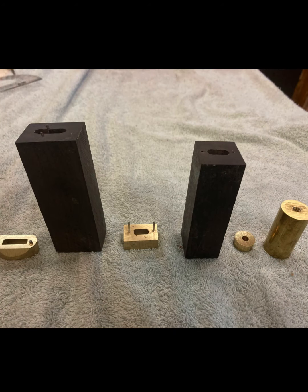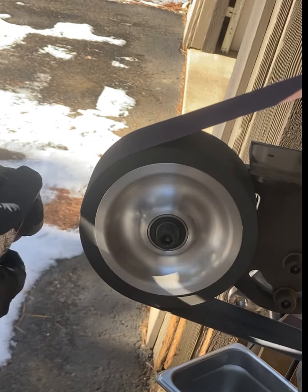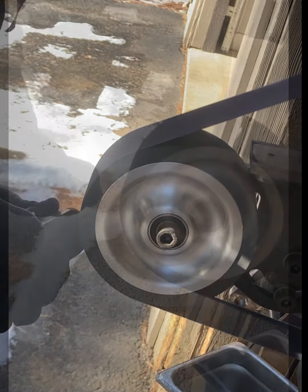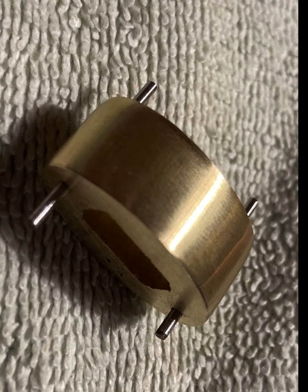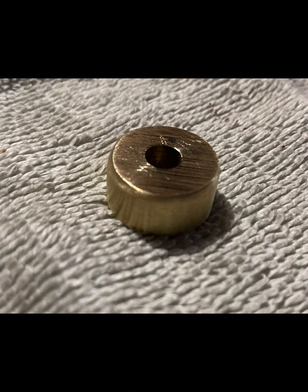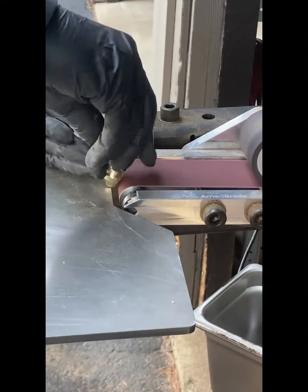All of the pieces of the handle assembly now have steel lineup pins in place. Next I will begin to carve the individual pieces of the hilt furniture beginning with the bottom section of the handle, which is being formed from African blackwood. The upper handle spacer from brass. The upper portion of the handle from African blackwood. The mid-handle spacer was made from brass. The most challenging portion of the handle build was forming the brass pommel, which will hold together the entire takedown construction of the hilt.